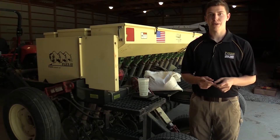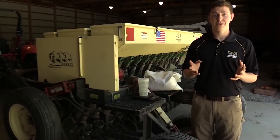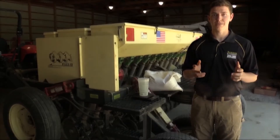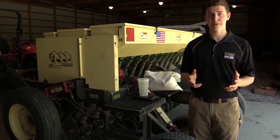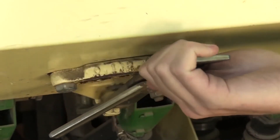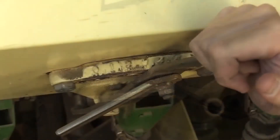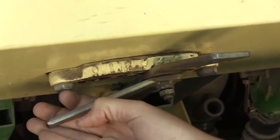Our desired seed rate is 6 pounds bulk seed per acre, which equals 4 pounds pure live seed for our seed mixture. So we will need to move the chain to the right to a larger sprocket to decrease our seed rate. Now that we have adjusted our seed rate, we will recalibrate and make adjustments until we reach our desired bulk seed rate. When calibrating the small seed box or the grain box, all steps remain the same except adjustments are made on those seed boxes independently — moving the lever to the right to increase or to the left to decrease. Remember to lock the lever down when done so your seed rate doesn't change while planting.